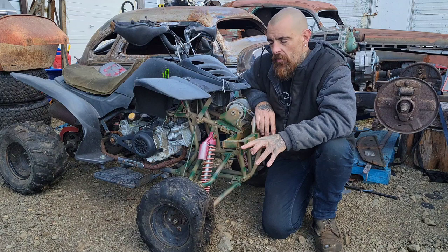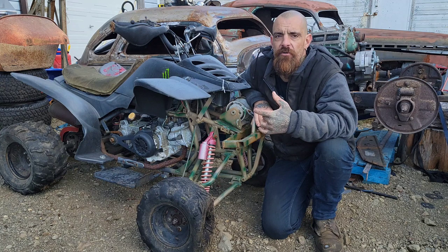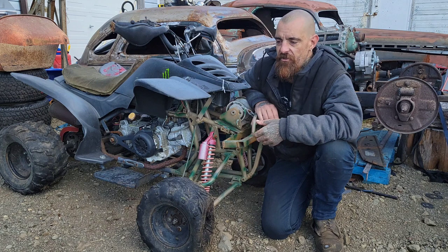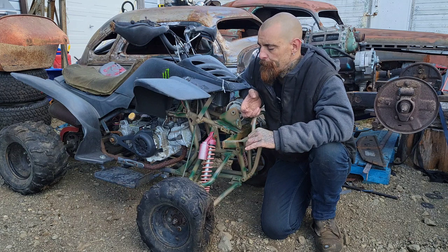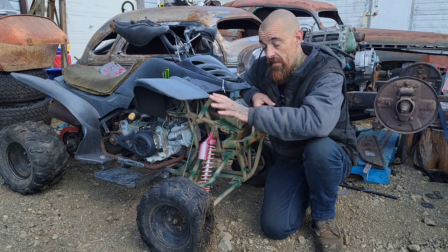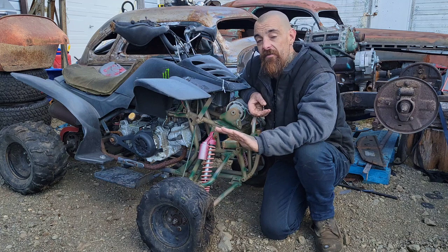If we break it all down, by the time you buy front hubs, your steering components, your clutch, and that clutch is basic. If you go with something a little fancier, what most people do is the bigger torque converter style with the slip belt in it. That's going to run you more like $100, $150, $200. If you start to add up all of these components, the clutch, the chain, the sprocket, the bearings, your front hubs, your steering, if you go out and buy all these parts, which realistically most people aren't going to buy used because they get beaten up, they wear out pretty quick, you're going to get into $200, $300, $400 really fast. After that, we've still got wheels. The brake alone in the back could be $100, $200. If we break all that down, we get to $500 really fast on a go-kart.